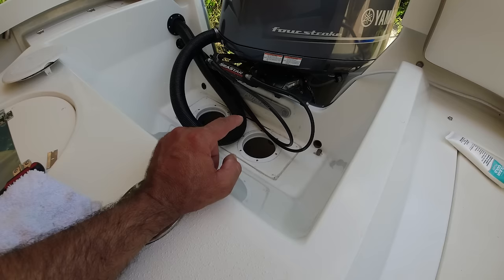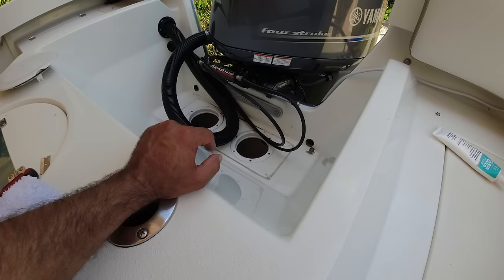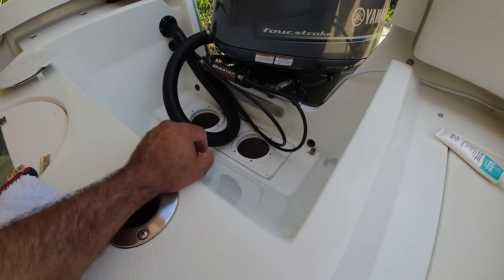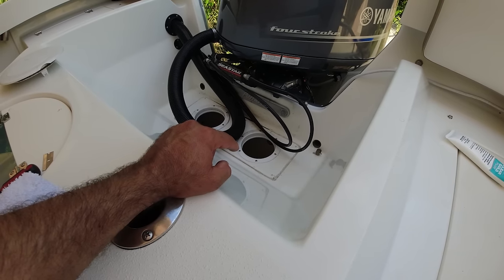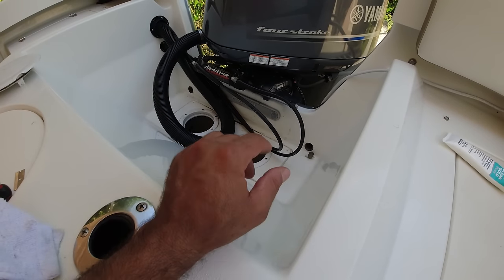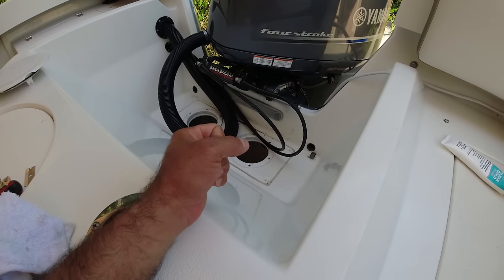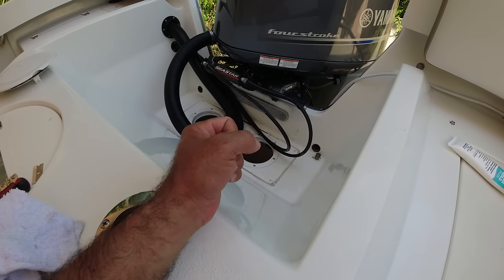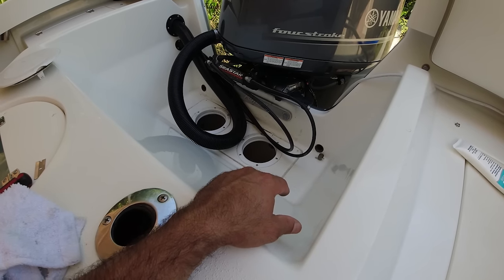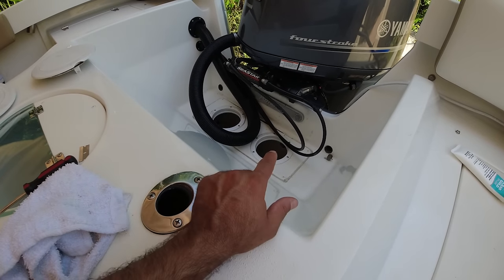There was water coming inside the bilge, and the shrink wrap on those connections had not been heated to make a complete seal. I was very disappointed that they didn't heat those shrink wraps properly, because that could create a problem with corroded contacts. Now it's working perfectly. Even on a brand new boat you can have problems like this — manufacturers work fast and sometimes miss a little piece of rubber, and you end up with a bilge leak. Very unfortunate, and I had this for two years, but I finally got onto it.